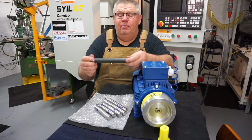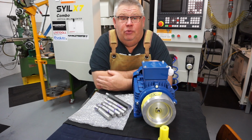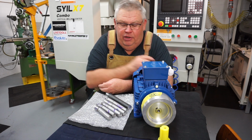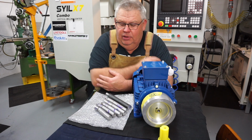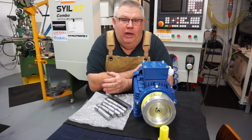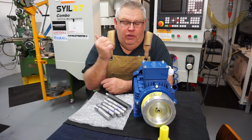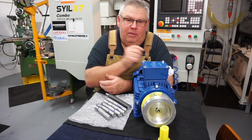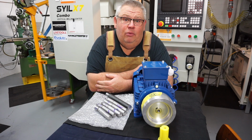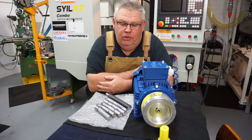And I machined it all out of that black bar, which is horrible to machine, and that's why I switched over to a nice sharp high-speed steel tool bit, and ditched the carbide to do all the OD turning with high-speed steel. I didn't have to touch it or tickle it throughout the whole run, but I noticed it was getting blunt because I had to go in an increment on the Colchester on the last couple to keep a consistent size. But overall, I was quite surprised how well the old Colchester still holds the sizes. She's a good old girl.